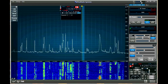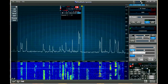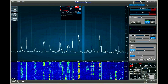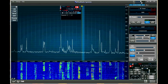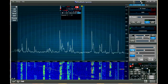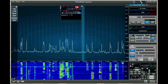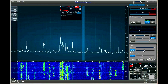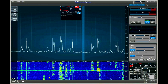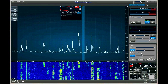We've got your AM carrier control for when you're doing AM transmit. VOX sensitivity and VOX on/off — VOX does work in digital modes. You can set up the SmartCAT interface so you can come in on a serial port and key the radio from an external program, but truthfully you can just kick VOX on, it works in digital modes, put the sensitivity up, and as soon as that output program sends audio to the SmartSDR with that DAX channel selected, it will key the radio up. There's nothing illegitimate about doing it that way.